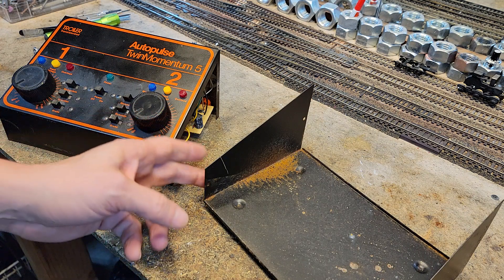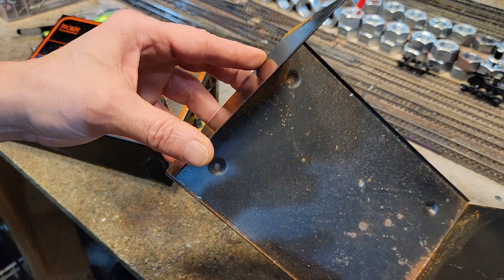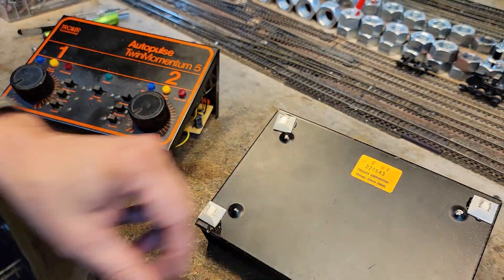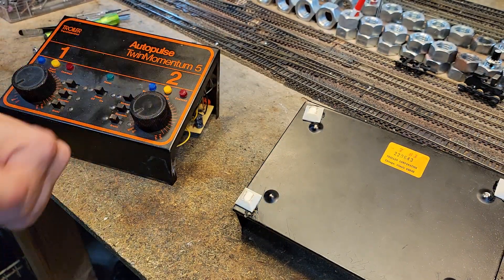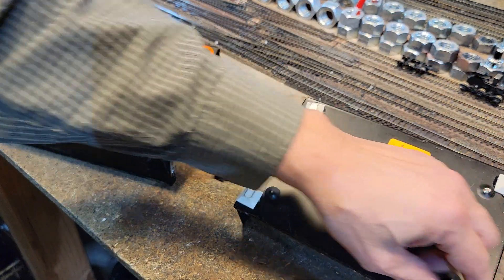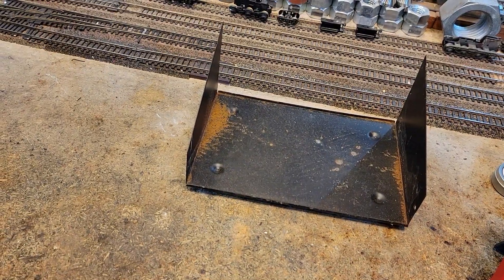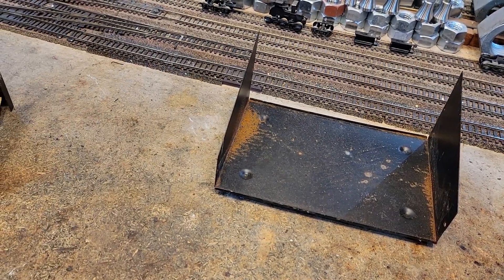This one's got some rust in it. It's history, so we need to clean all that out and we're going to repaint it. A couple years ago we got some white rubber feet, probably from Ace Hardware. These are fantastic - we used a little Goop and glued them on. Normally on the Tech 2 and other power packs I've been using brown rubber feet, but these are softer, they grip really nice. We're going to clean all the rust out and repaint it with rust-preventing primer, then a nice glossy black enamel and probably a glossy clear coat - it's got to look better than brand new.